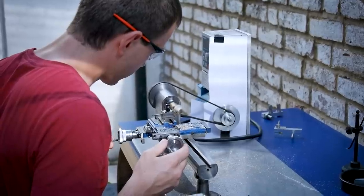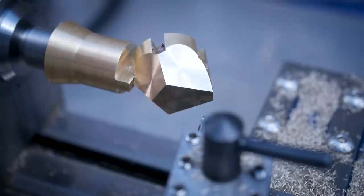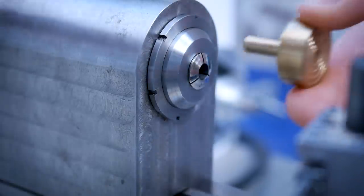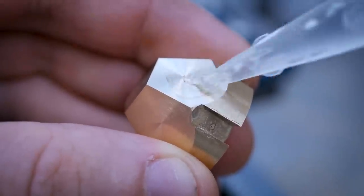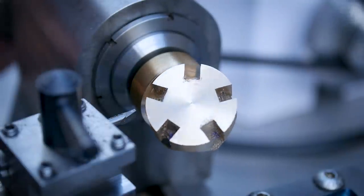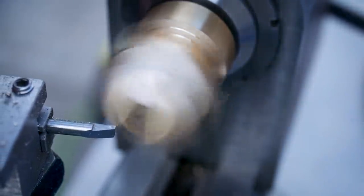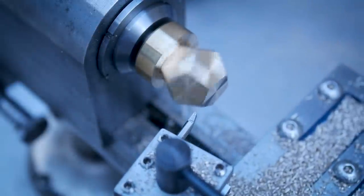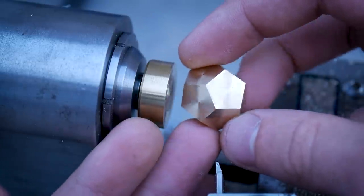And that completes the machining on half the die. Now we're onto the home straight, because all the other faces are opposite to those finished. It's just a matter of mounting onto the superglue arbor and facing off the opposite faces, removing the shaped grooves. So that's the machining of the dodecahedron complete.